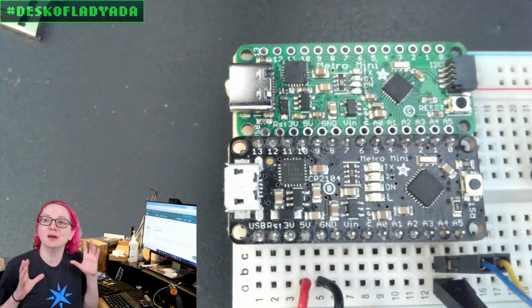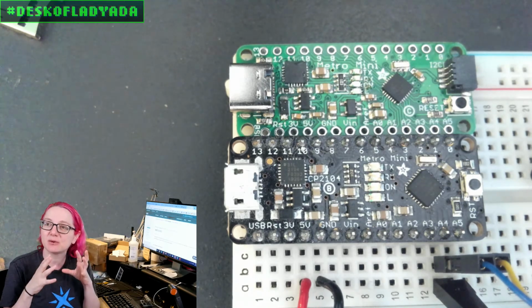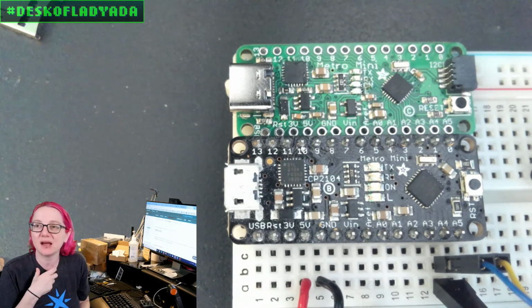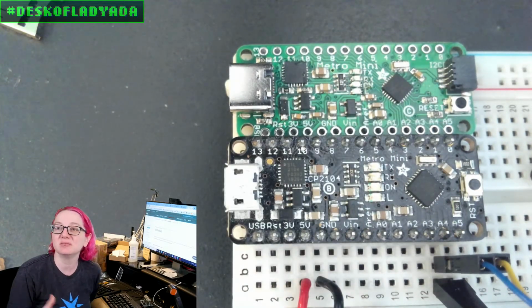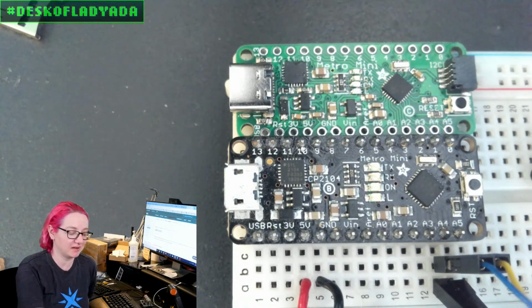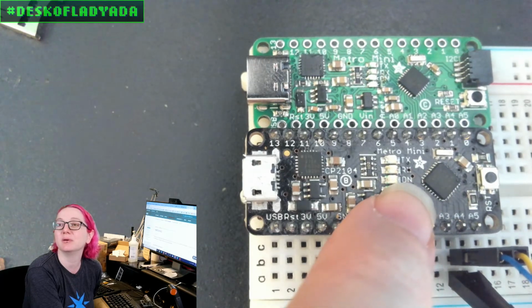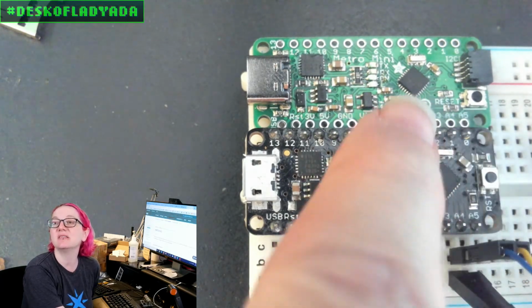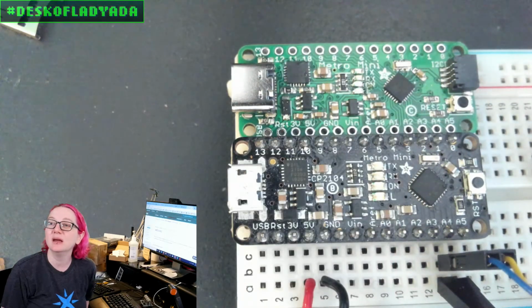It's one of those weird things where the different package was available. So I snagged them, and I'm going to release this with the 28 QFN until I get through the 8,000 pieces, and then I can always revise it. I made sure that there's space, so I could make it fit this bigger chip. And with the space I saved, I've got a STEMMA QT port at the end there.